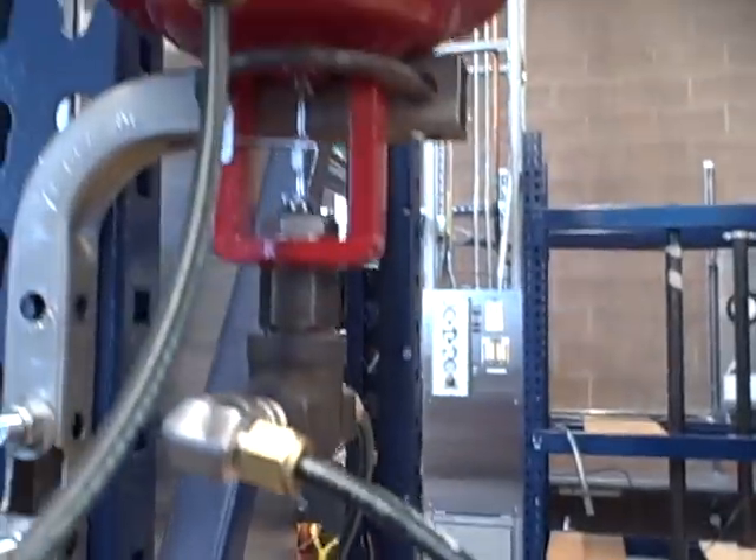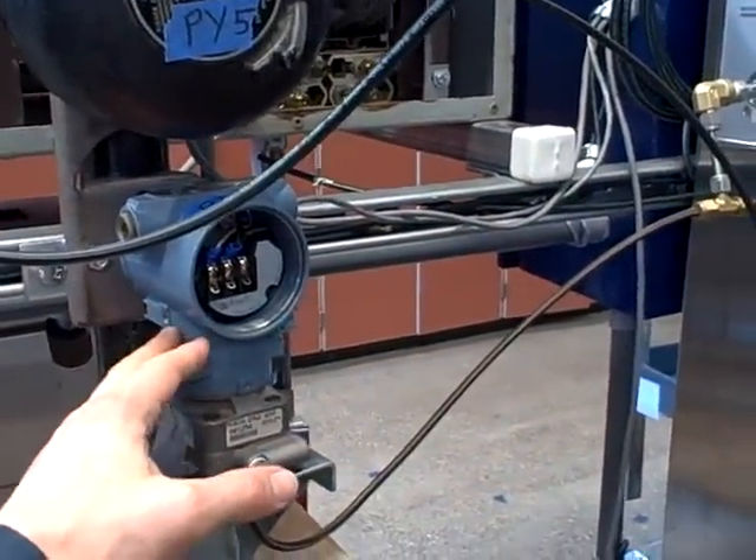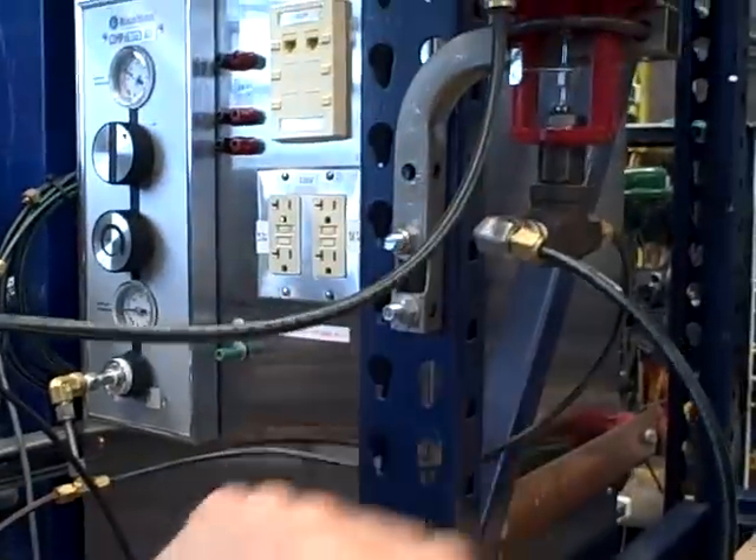So what I'm going to do now is go over to the controller and put the feedback portion into manual mode, so that we will only have feedforward control working. We're now in manual mode, so the feedback portion will not take any corrective action — only the feedforward action will work. What's going to happen is we'll only see the effect of this transmitter sensing the supply pressure load and making adjustments on the valve.